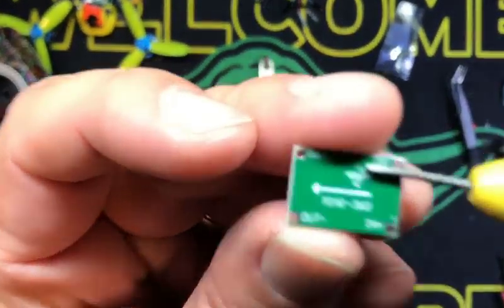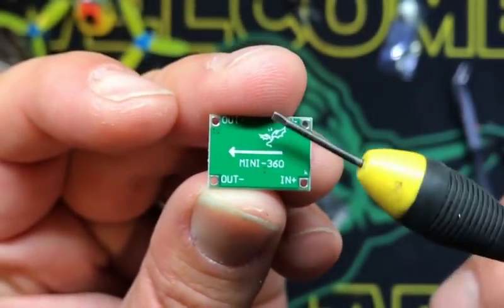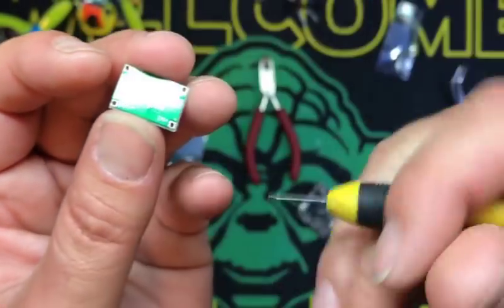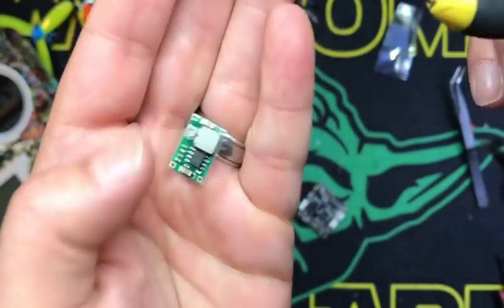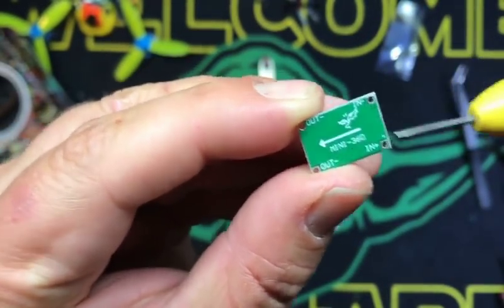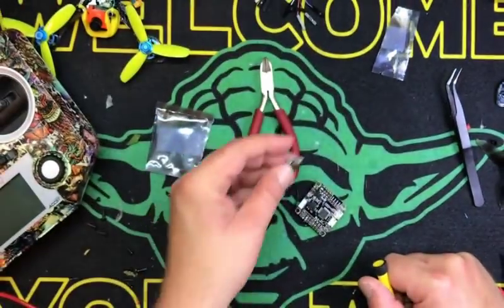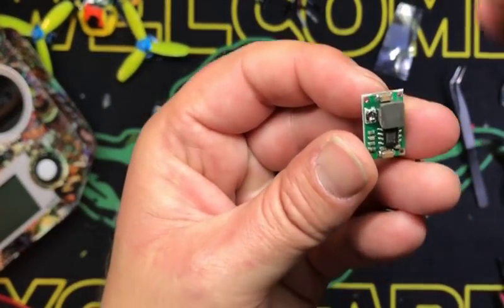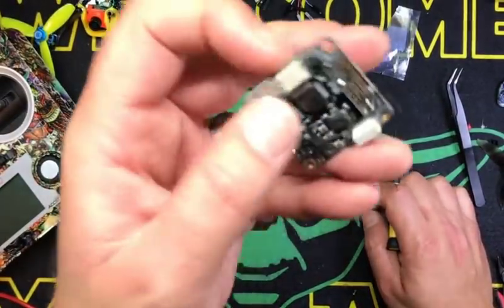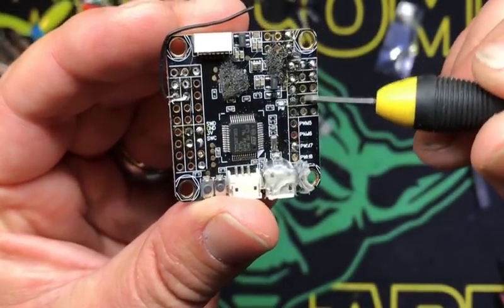So your input wires are your battery, right? And I think these are safe up to like 6S. Look in the description, but I run 4S for the most part. So I use these quite a bit on that. So your 4S input and your output now, since you tuned this, is going to be 5 volts. Now, take a negative, like a black wire and a red wire, and solder them into your outputs. Then bring them into your flight controller on any of this rail.